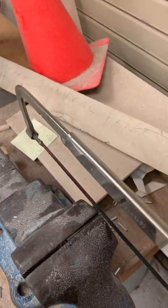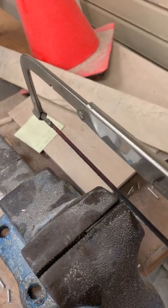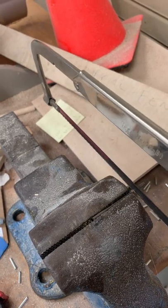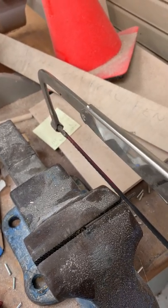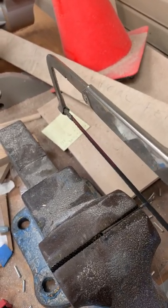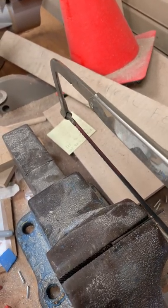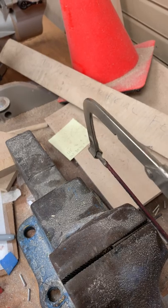It's going to be a little hard for me to do this one-handed — I usually use my other hand to brace the vise so that it doesn't wiggle or move. You're just going to use that saw. I recommend going in one direction a couple of times just to create your starting groove, and then you'll be able to go back and forth actually sawing through your axle.